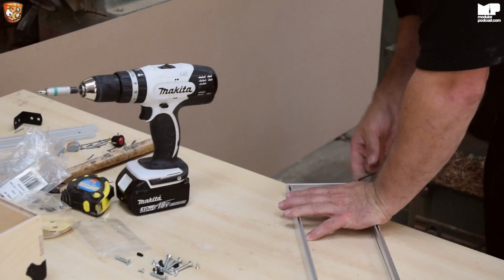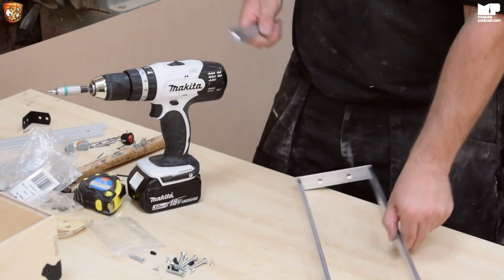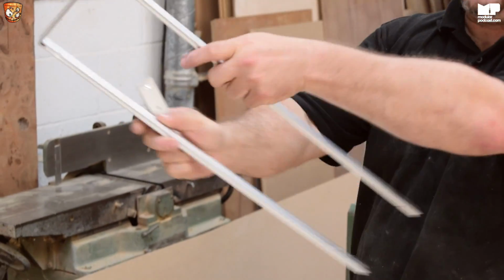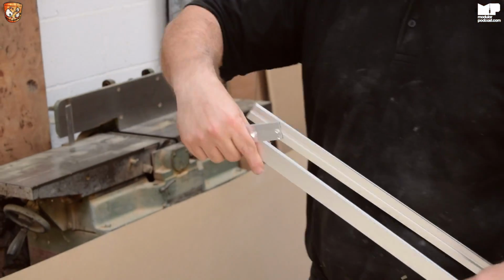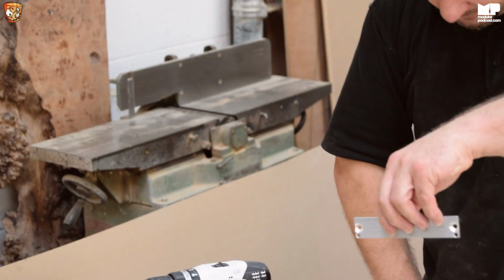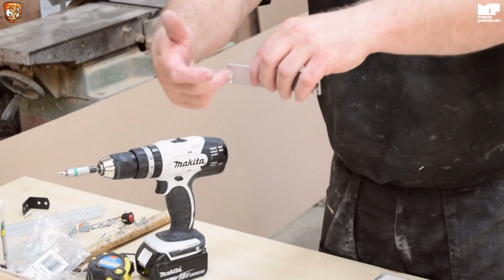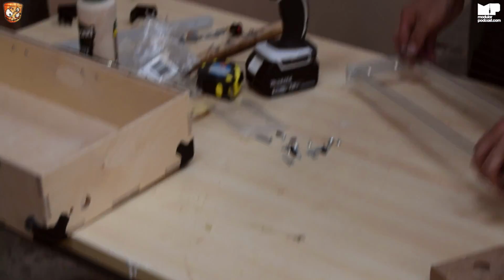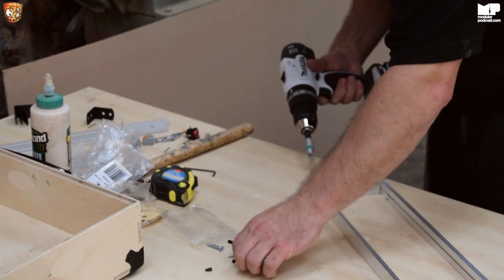Now, the little trick I'm going to show you in a second is regarding the other bracket, and I've done this so many times, it's so annoying that I have to not let you do it. Remember, your locking pins have to be at the back, because if they're at the front, they will foul your threaded strips, or they'll foul your square nuts, yeah? So, when you're putting this other bracket on, you're going to make sure that the holes, because the locking brackets are at the back, are there, but you make sure that these are going that way. Sorry, these are going that way. That the main holes fit, you see. So if I just turn this around for a second to fix it, I shall show you once I've done it. Didn't like that one anyway.